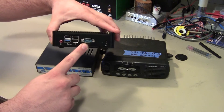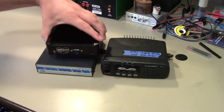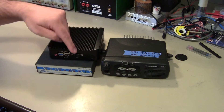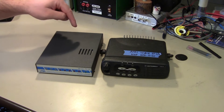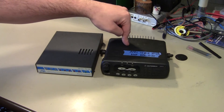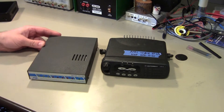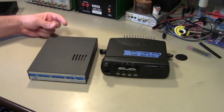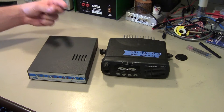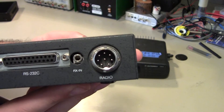The Quotam Q190S already has a real RS-232 port, so it's just a serial null cable from there to the TNC. The TNC has a DB25 serial port on the back. However, the audio cable between the KP-88 and the CDM750 is a bit of a problem. Most other TNCs I work with have a female DB9 connector for audio interface, but the KP-88 is different.